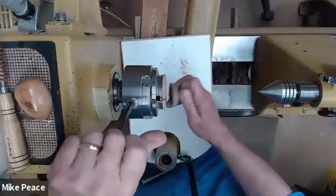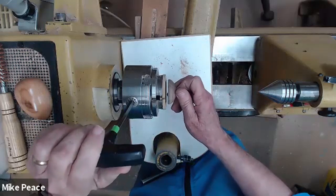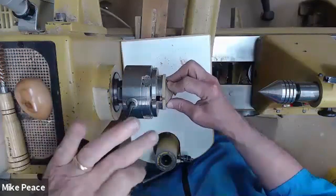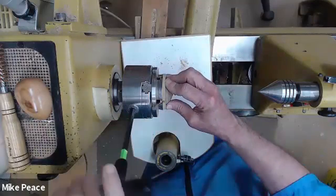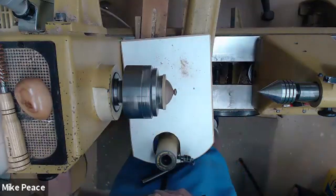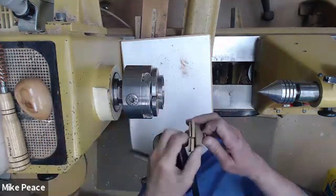And it's a kind of lid that you couldn't mount snugly in the box because it's not shaped that way. It's supposed to be kind of loose. So you make this little collet with, in this case, parallel walls, and this will work like a champ. Then you can finish off that bead by using that wooden collet, and you couldn't easily do this some other way.